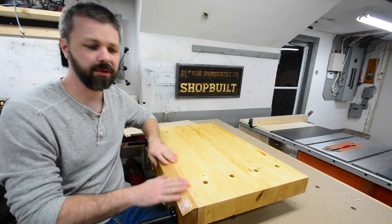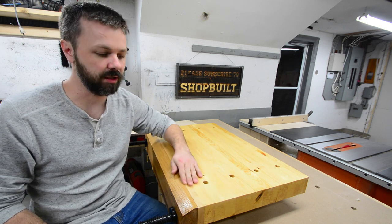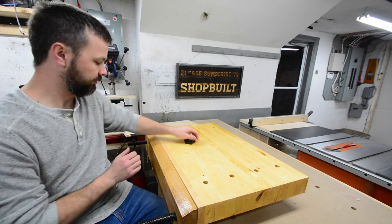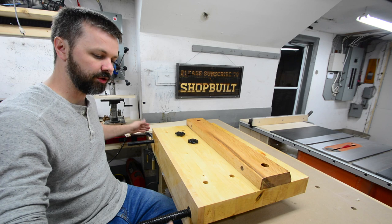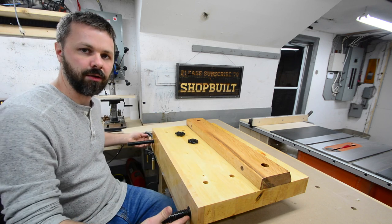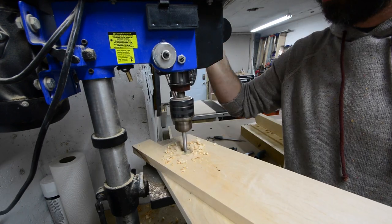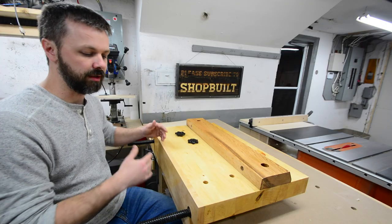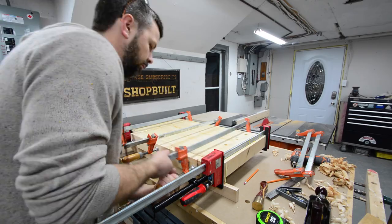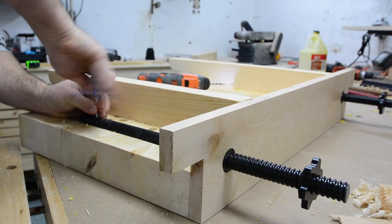The vise construction is actually quite simple. I'm using two different materials, just because of what I had. I had a piece of eight-quarter oak — I wanted a nice thick piece for the movable jaw — and a piece of four-quarter maple for the fixed jaw, which I think is fine because it's got the support of the bench behind it. All I did was cut my maple piece six inches longer than the bench top, which allowed a little space for clamps on either side. Then I laid out where the holes needed to go for the threaded rod, countersunk those holes for the flange, and drilled my through hole. Once all holes were drilled, I glued the maple piece to the bench top and fastened my threaded rods using two three-inch lag bolts through the holes already in the rods.